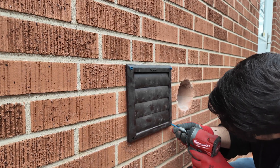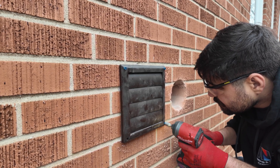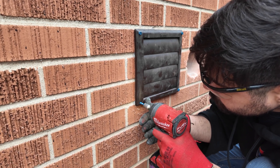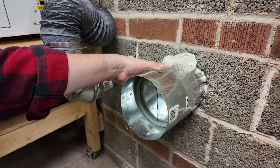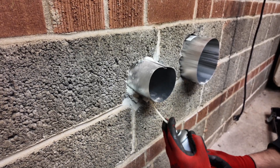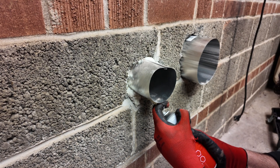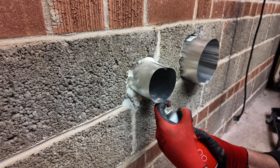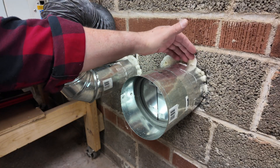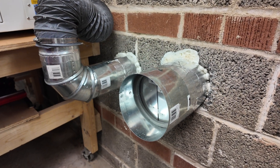He's going to drill holes to attach it to the brick, and if he does a good job he'll silicone around the outside after fixing it in place. Then he's going to take spray foam and fill in all the crevices. After it dries, you just take a utility knife and flush it to the brick or mason. And you might think you're done — but there was one thing missing from my assembly.